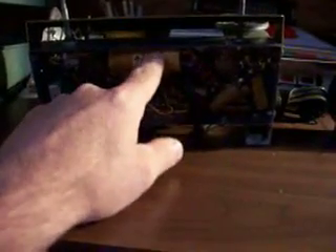There's eight caps and an electrolytic that need to be replaced in here. As of right now, it'll come up and it'll just hum — bad electrolytics, of course — and I haven't gone any further than that. The speaker is getting very brutal around the edges. It's cracked, it's dry. You can see where it's kind of split there; it's got a split here, which was cracked when I took it out of the cabinet. It's free — it will move.